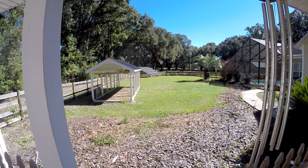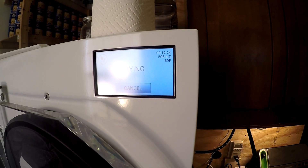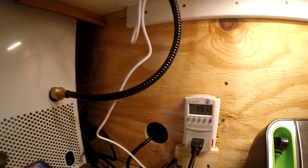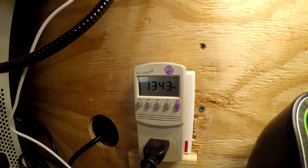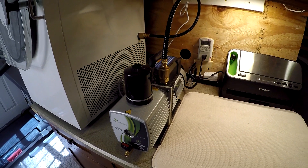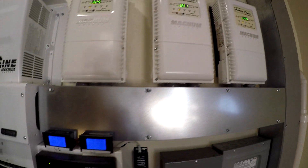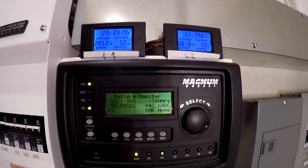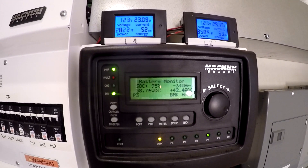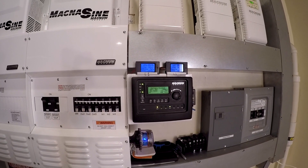Quick update — it's almost noon, we've got a lot of sun coming in, blue skies. We're still in drying mode, we've been running for about 3 hours and 12 minutes plus the freeze time. We've pulled two and a half kilowatt hours, still bouncing between 1,300 and 300 watts depending on the heaters. Over here you can see pulling about 10,000 watts on the panel, burning through about 7,000 watts in the house, and we've used about 10 kilowatt hours today. Putting 40 amps into the battery bank and we're at 95% charged — things are looking good.